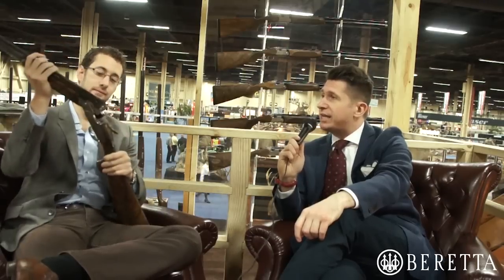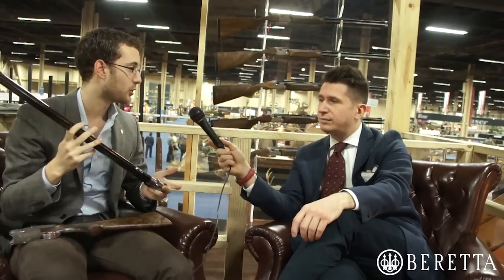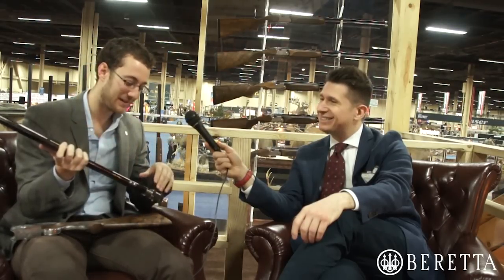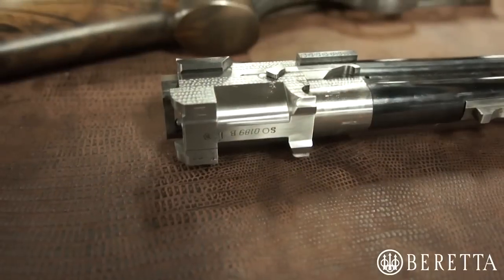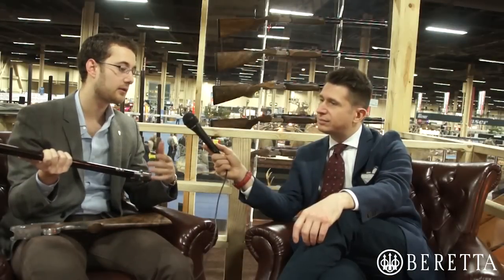A barrel is a barrel is a barrel, everybody says. But the barrels in this type of gun are actually much higher quality and tensile strength than any barrel you'd find even in entry-level Beretta guns. This is what we call a demi-block barrel. In traditional guns, the chamber is fused to the barrel. With this, the chamber and barrel are formed from one piece of steel, which means the starting block of steel has to be larger. It's also industrially a very difficult process, and only Beretta and a couple of select other bespoke gun manufacturers can do this.